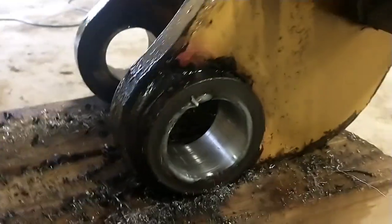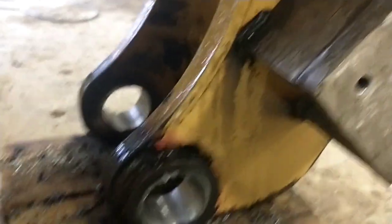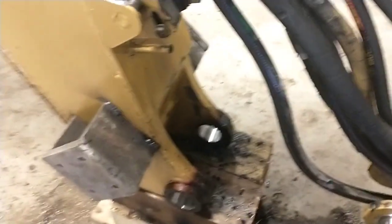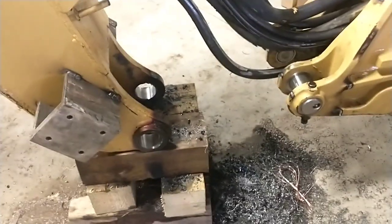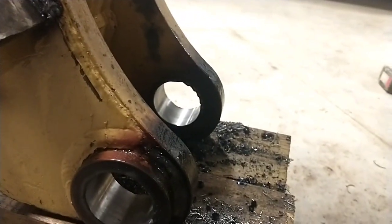All right, we're done with the boring — got a nice finish in there, looks good. These are so close to the size of my boring bar that my measuring gear won't fit in there, so I measure by digging through my drill bit collection, finding drill bits that are right, and feeler-gauging next to the bar. That's not super precise, so I intentionally leave them a little tight. Right now these bores are both about five-thousandths small — that's quick work for the sunnen hone. I've got to quick-grind the faces smooth where my weld came through, knock those off, and then I'll get on here with a rigid hone, and then we're going to press some bushings in.